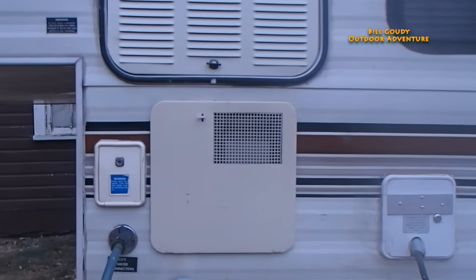I have to put a switch in for the water heater to turn on, so I'll put a lighted switch in. When it comes on, I'll know the water heater is on. You can't turn this on without having water in it — the electric element will burn out real quick if you try to use electricity without water installed.